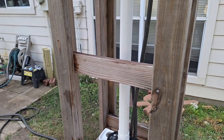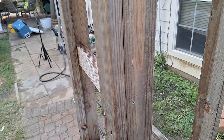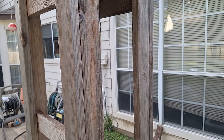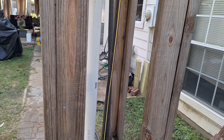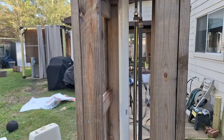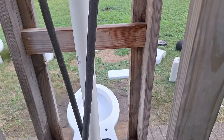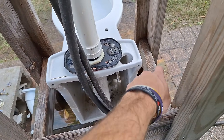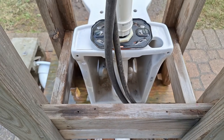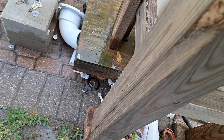The frame is a pretty simple build. I have eight two-by-fours — one set goes this way and one goes this way, because if you only used one direction you could push it and it would sway back and forth, loosen all the nails, and fall over. Doubling the two-by-fours means you can push it any direction and it won't fall over. I also put in cross beams to help with swaying — one in the front, a few down here, and an extra one up top for additional support. I like to screw them in from the sides so it does not go directly into the end grain.